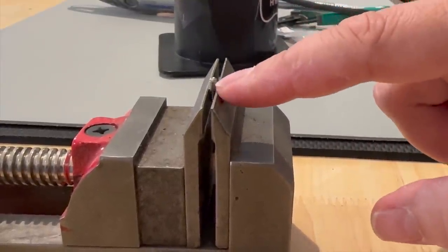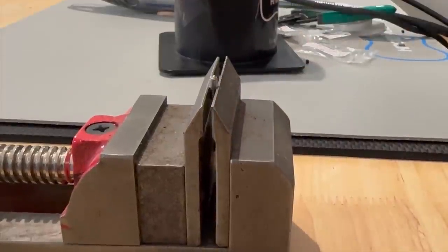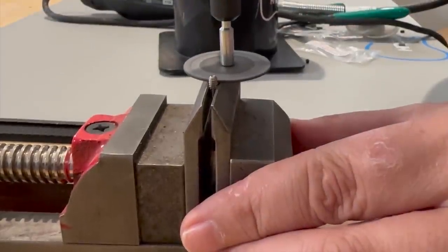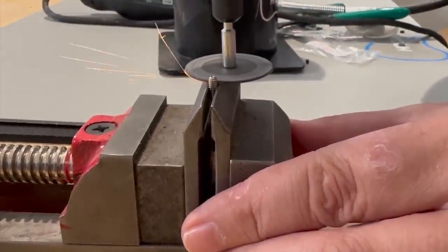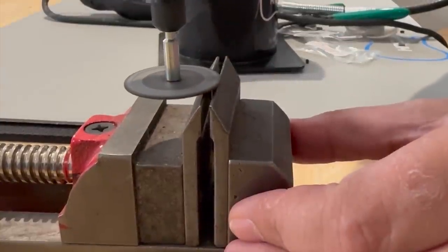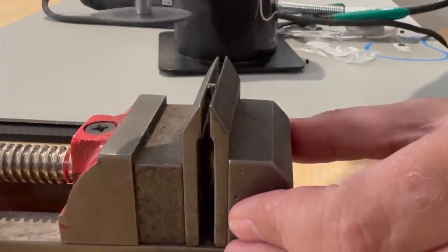You can take one of the longer screws and cut them down. I just put them in a vise, and then I use a Dremel. You just want to make sure you don't do two things. Don't compress it so much that you damage it. And also, when cutting, try to stay in between two grooves, and then polish off the end when you're done so that there's no sharp edges that can cut into the metal of the bridge plate.